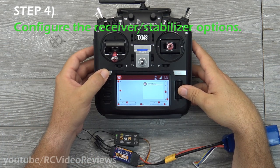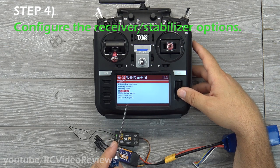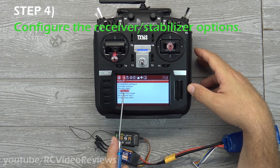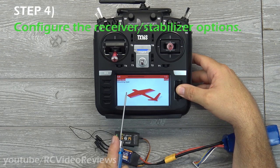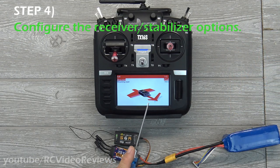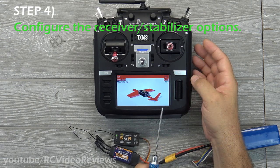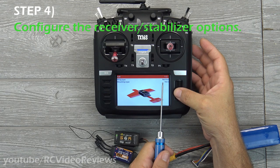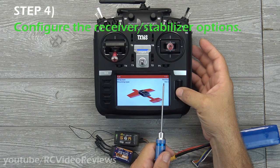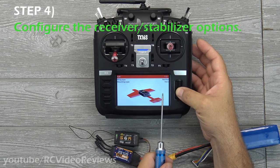Press the system button and on the tools page you'll see an option for FrSky S6R. If you're wondering about these scripts, just download the SD card content for your current version of OpenTX and the directory structure with the tools will be set up for you. Click FrSky S6R — one way to tell right away if you've had success is if you start reading variables on the side. I don't have a V-tail, so I'll press the jog dial to change it — once it's blinking I can change to delta wing or normal. For my Buffalo example that's a normal wing configuration: separate ailerons, elevator, and rudder.